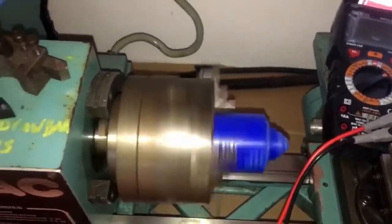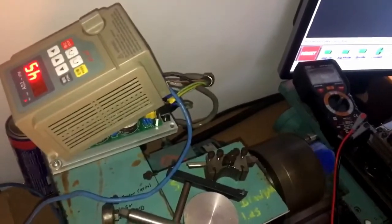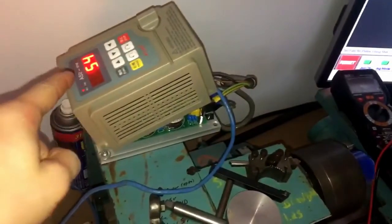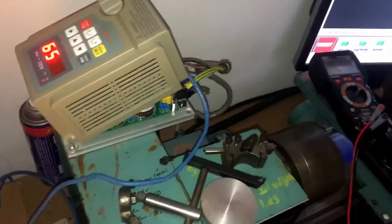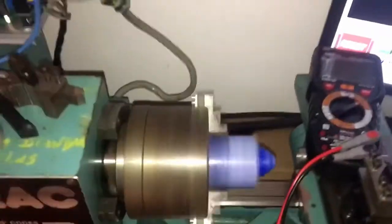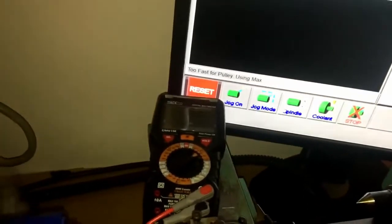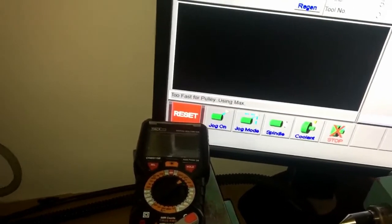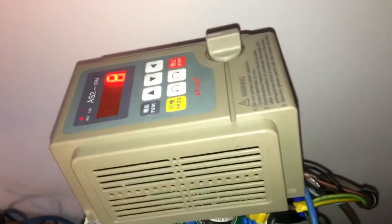So let's go to 2000, which is the max RPM of this machine. You'll get an idea of the ramp-up here. I think this is frequency being displayed here. And there we are — finally we are able to control the spindle. So if I do spindle off, it's going to shut off, but very slowly, because again the ramp settings are not adjusted properly.